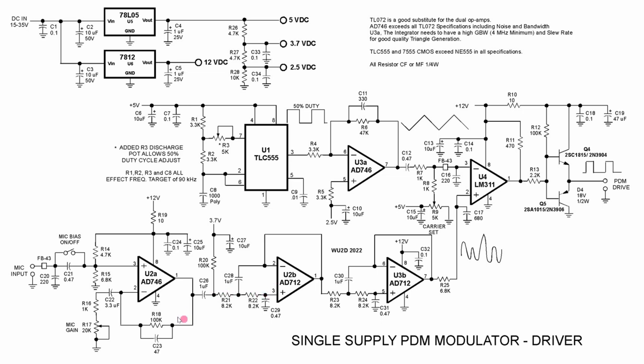These amplifiers are all being set by this bias voltage coming in on this 100K resistor. And since these are all DC coupled, the DC goes all the way to the 311. So really, we're working this voltage here against this voltage. So this is going to be set around 3.7 volts. This is at 3.7 volts.